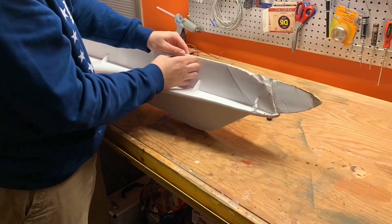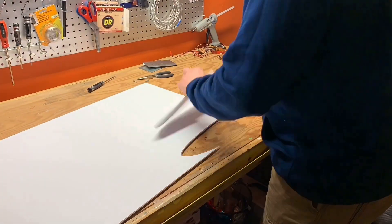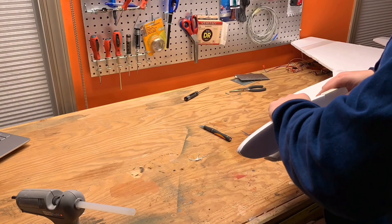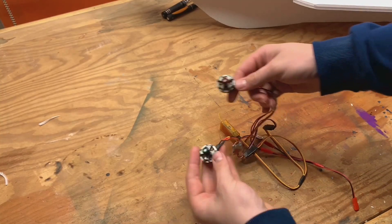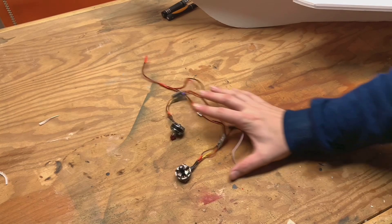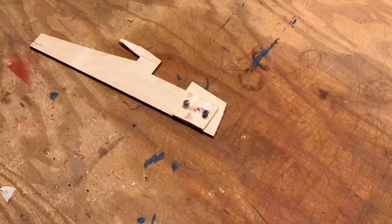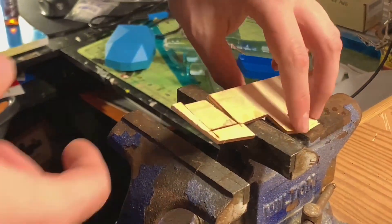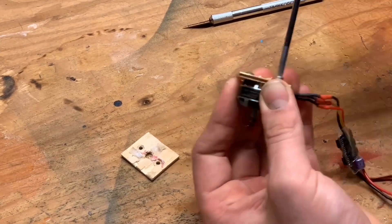So to build, I'm going to remove this steel plate, which I used for nose weight when it was a chuck glider. Then I'm just going to cut off this old broken nose and cut a new one to replace it. That's going to give us a nice sleek and clean look. Now I grabbed some electronics — two 2300kV brushless motors set up on two separate ESCs. The first step is to make a motor mount; I'm making two of these using eighth inch hobby grade plywood. Once we get that square cut out, we can drill some holes and screw the motor onto it.